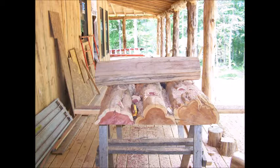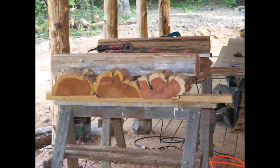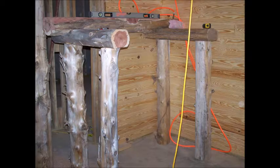And then I'll go ahead and cut out a notch on the back, 2 notches on the back of this platform. And these notches will be sized down to 5 inches thick. And then once that's done, I'll go ahead and start the rails. And the rails that you see sitting on top of the platform, they'll be sized down to 7 inches thick. And these rails will be for the underside of this platform to secure to and be held together, so there's no rocking in the platform on the top.